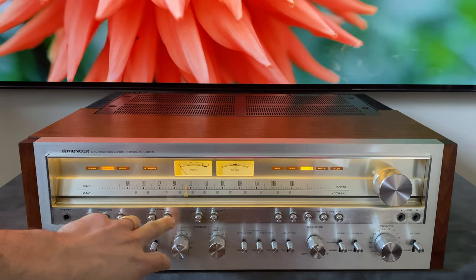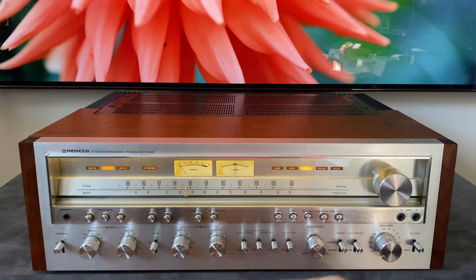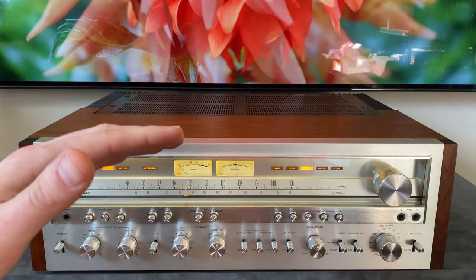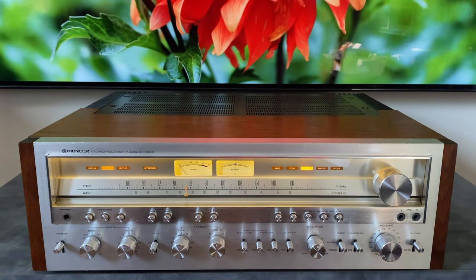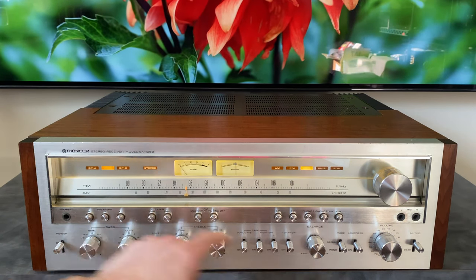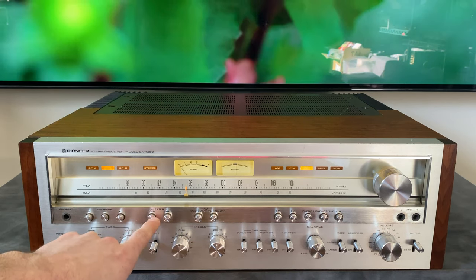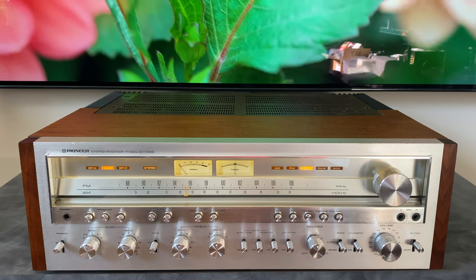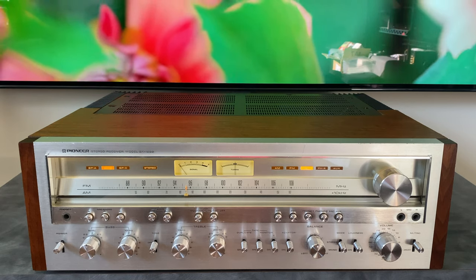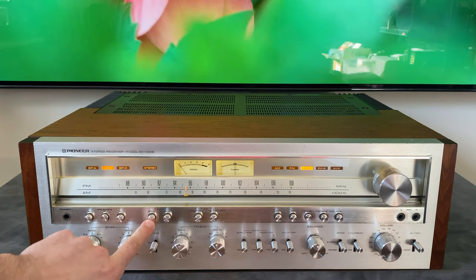So starting out with the filters up here so that we can be done with this top section, the 8 kilohertz is just going to cut the very, very high part of the music. It's basically like a filter that just cuts out the highs. So if we're hearing cymbals, you'll kind of lose some of the top end of the cymbals. The 30 hertz, this button is mostly for turntable rumble. So if you notice when you're walking around your floor, or when your system is just idling on the phono input, you can see the cones of your speakers pulsing in and out, you might have some low frequency vibrations that are working their way into the phono cartridge. So this will help with that.